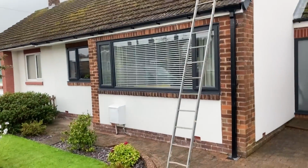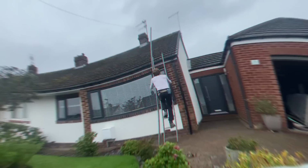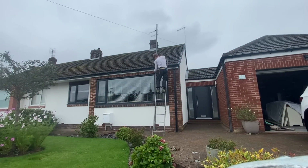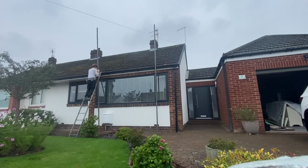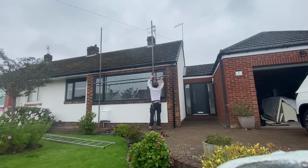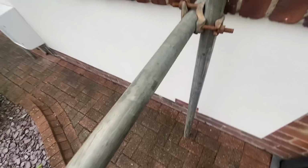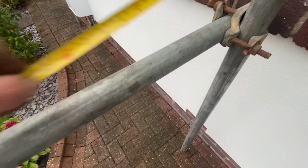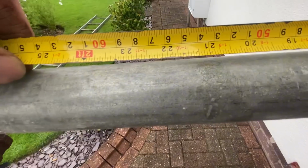I'll just start by coming off the gutter, I think. Drop a couple of standards in there and I'll take it from there. Just going to make this base 2 boards wide. So the measurement will be 20 inches to the outside standard, which is there.